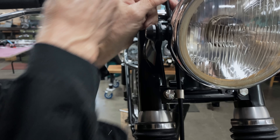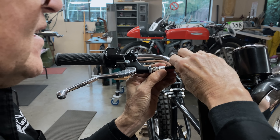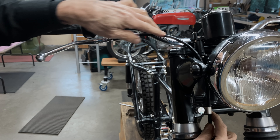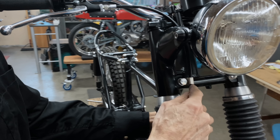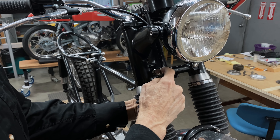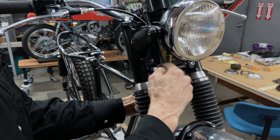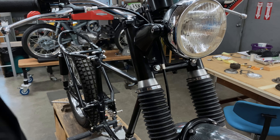So this is where we're at right now — we got one, two. So this is going to be an arc like that, and as the wheel moves up and down, this needs to slide in here. So that's where the delrin comes in. We're going to make a new one of these. It's going to have a larger hole, the bolt is going to get sunk into the delrin, and we're going to make some kind of a shape — I'm not sure what.